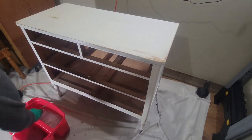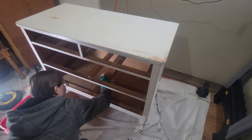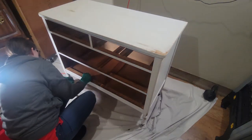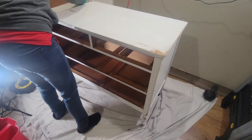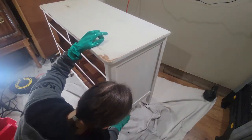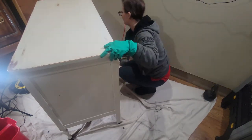Now that all the repairs were made on the outside of the dresser, I am going to clean it with some Simple Green all-purpose cleaner. This will make sure that your paint adheres properly and that you don't gunk up your sandpaper when you give it a sand. This piece was on the side of the curb, so it's always a good idea to clean the inside as well as the outside of any piece you pick up, especially ones sitting on the side of the road. You don't know what has gotten into it, and there was a little bit of a musty smell as well.